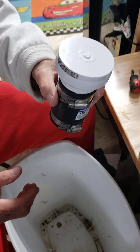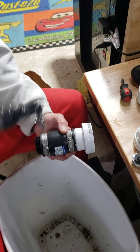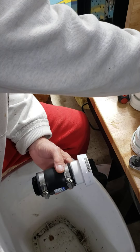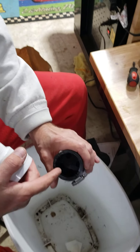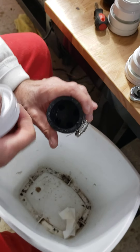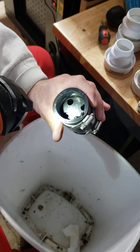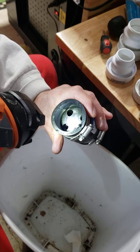This is how it will mount into the standpipe. Hopefully this helps some people out. Just got to remember that you have to drill holes, because on your standard air admittance valve, the air inlets are on the side. So you've got to drill your four holes and make sure those holes don't interfere with the plunger assembly in the center — I show that in the other video. Those four holes will allow enough air to go through.